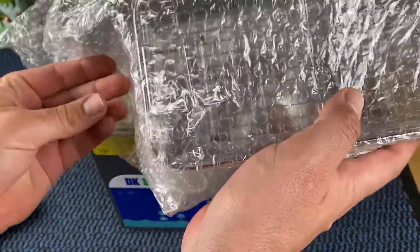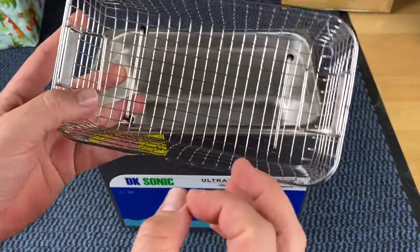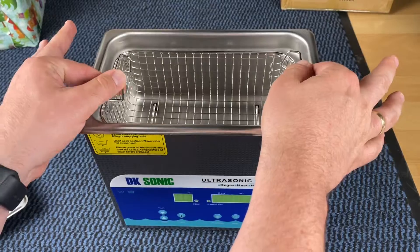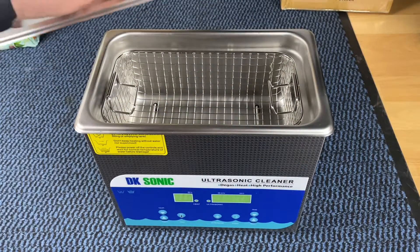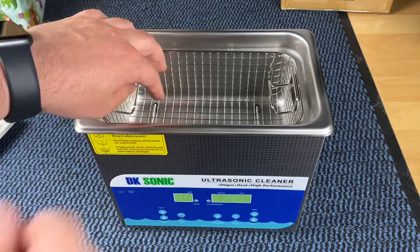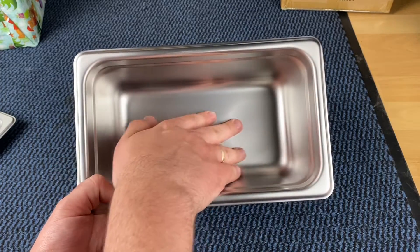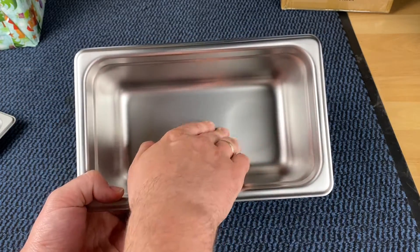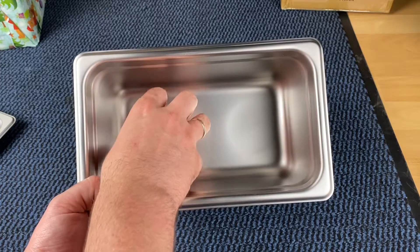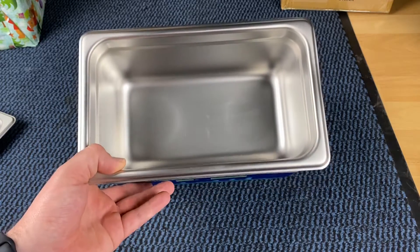The best cavitation temperature of water is 60°C, and you can go up to 80°C with this device. There's also a degas mode for improving the cleaning effect. Degas mode is an intermittent cleaning mode to remove residual bubbles and cavitation nuclei, which can increase the loss of ultrasonic transmission and decrease the blast range of cavitations — so it's a mode for removing ultrasonic fatigue to improve cleaning.